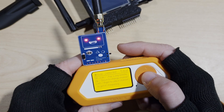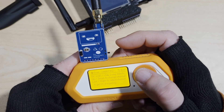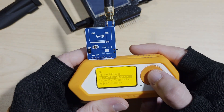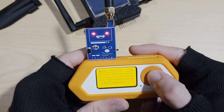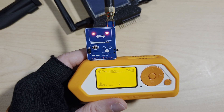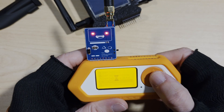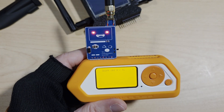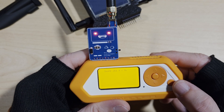If I click on channel scan here, you can see that the LED lights glow. There's a little switch where you can select between having the lights on and off. Using NRF24 on the Flipper Zero with Momentum firmware, we can select channel scan set to 2400MHz and click scan. We can see it's picking up some frequencies, and moving my wireless mouse seems to have a little bit of an impact. Like many before me, I've not been successful in picking up any of my wireless devices, as they seem to be protected from this kind of exploit.